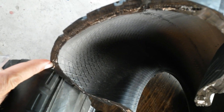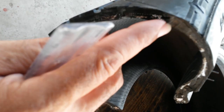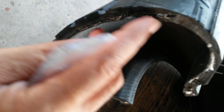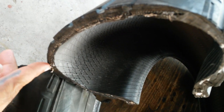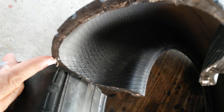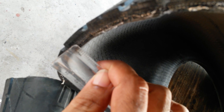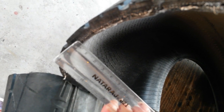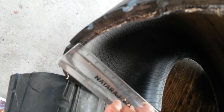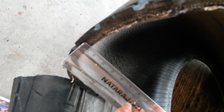The bottom looks like about 105 millimeters — just a rough check. The top looks like about four less here, probably about four less here too. I expect it to be symmetrical, even though it's been a bit roughed up here so I'm not getting a very good view. I would expect about probably eight less in total, so maybe 97, 96 millimeters on average. About two millimeters before the start of the wire reinforcement, and that goes for about one millimeter separation.